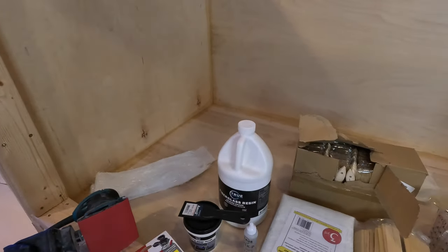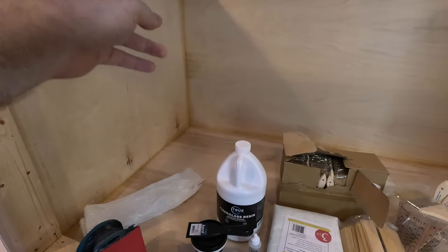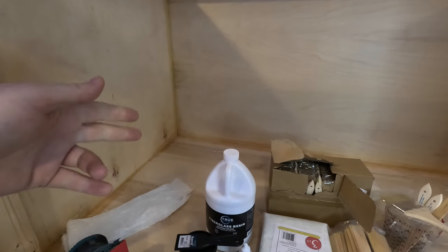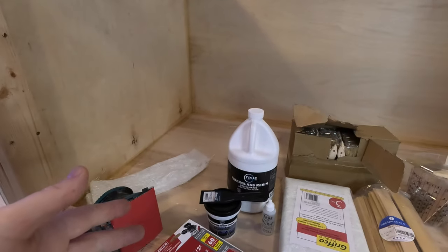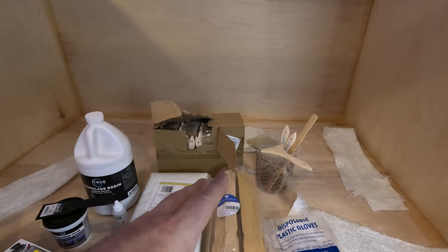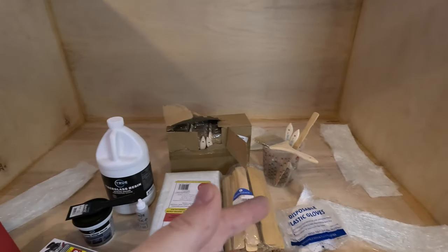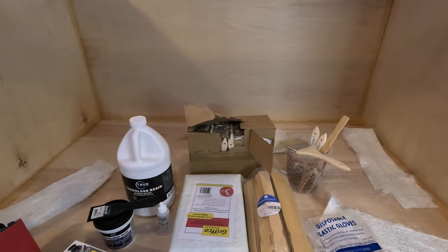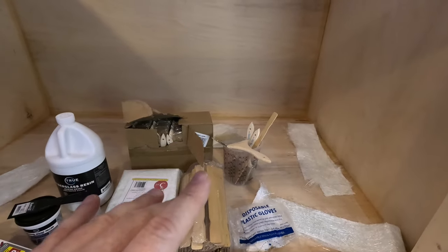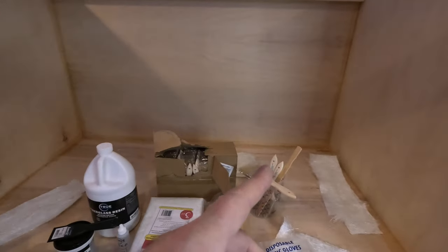It's one of those things I was explaining earlier in the video: you don't want to cut a little bit of fiberglass, start working on it with the brush and the resin, get it all over you, and then think you're just going to stop, take the gloves off, cut another piece of fiberglass, and start working on the next session. While you've made up a big batch of resin, it's hardening, you're on a schedule, and you don't want to rush. You don't want to be taking the gloves on and off, wondering where to put the brush. It just becomes a mess. So cut all of your fiberglass mat first, get it all positioned and ready to go, so that when you start doing the fiberglass, you just work on a piece, grab the next piece, next piece, next piece.